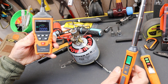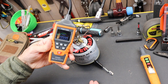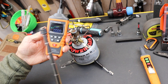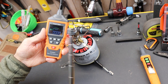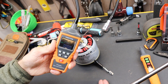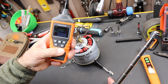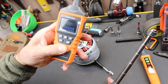This one's picking it up too — that's what the other beep is. I've zeroed it with a lot of gas coming out, which allows me to continue working. That's huge because a lot of times, once you're in a gas environment even if it's a small amount, you end up with all kinds of indications and alarms, but you can't always clear it out. So finding where in the pipe the gas leak is — which junction or wherever — is impossible simply because it's going off full blast. So that zero feature is worth the price of admission right there.